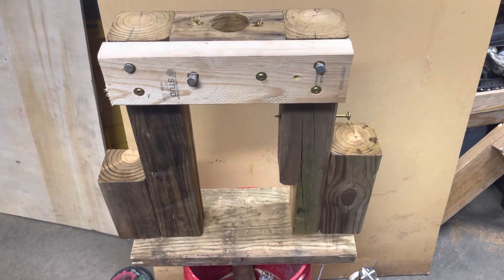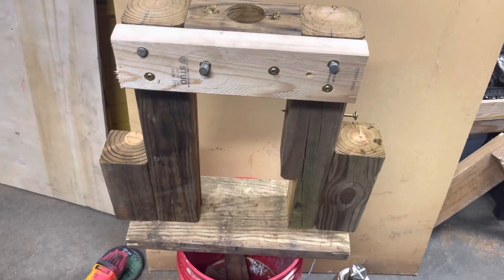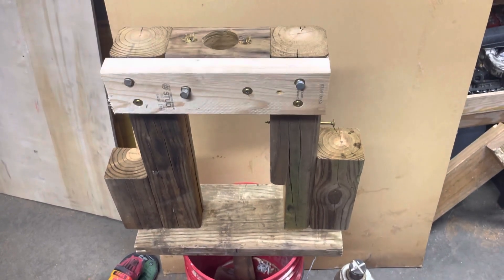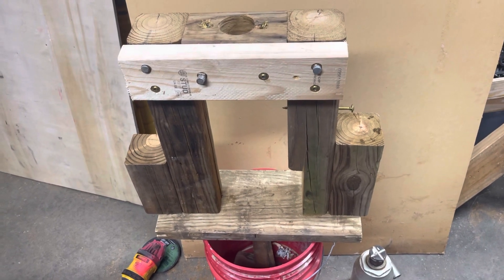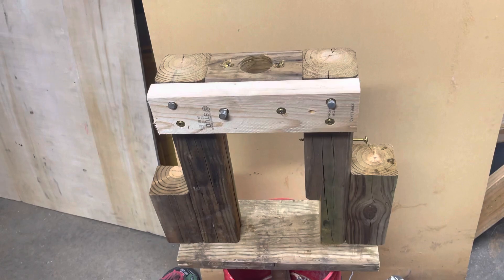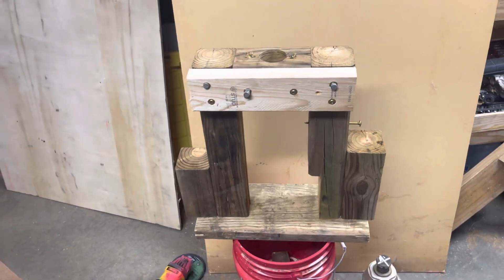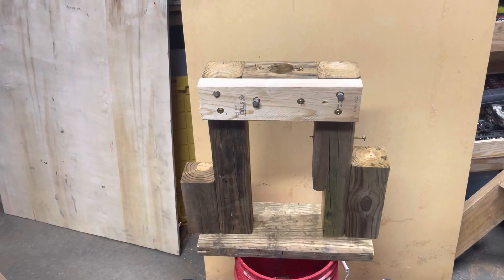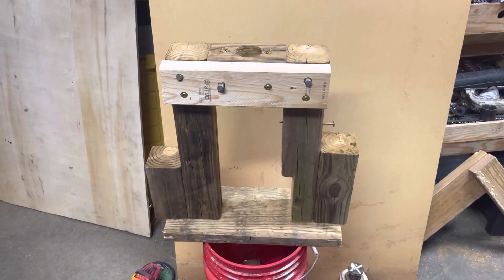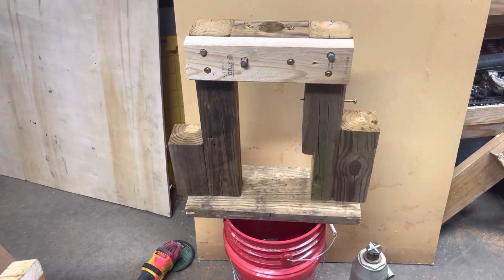You can use a fairly small jack to press your parts together. I stole a lot of these ideas from someone else on YouTube, based on designs of the ones you buy from the store. I've been pleased with it, and one of the benefits — if you have a really small shop like I do — is you can take this completely apart and either throw it away or save a few parts for next time. It only costs five or ten dollars in wood, and the screws are all reusable. If you don't have room for a hydraulic press, this may get you by on some projects. Thanks for watching — if you have any questions or comments please leave them below, hit the like button, and smash the bell icon to be notified of future videos.